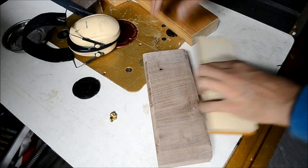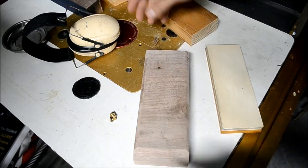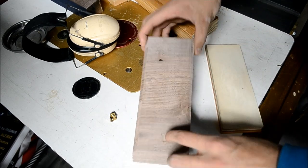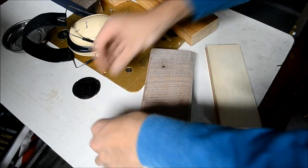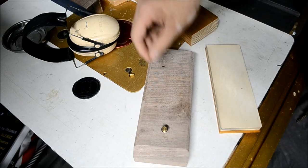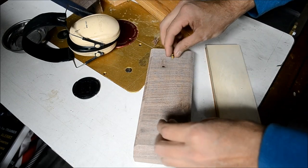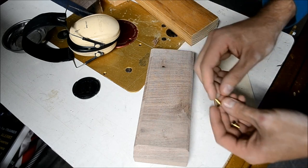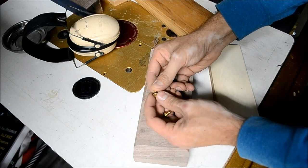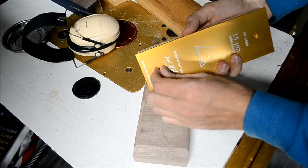I've got the piece of wood pretty much sized out and everything. I planed the edges just a little bit. I marked out where the holes will be. Now I just need to get some nuts that I can epoxy in there, and mill that out so that I can actually put them in there. I think I'm going to make these just a hair deeper for the O-rings. I think they're just a tiny bit too tight. Just a hair.